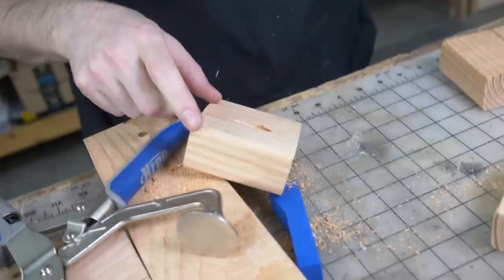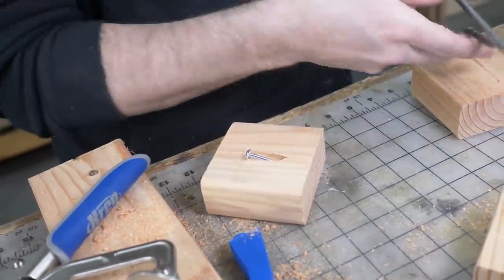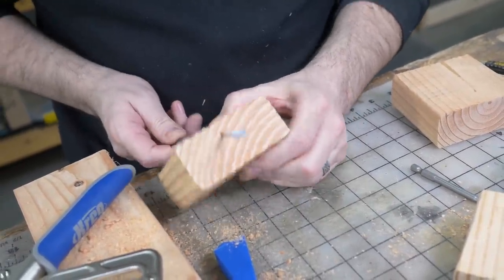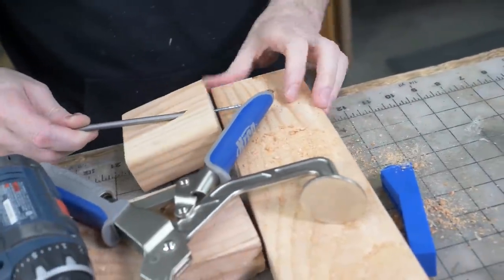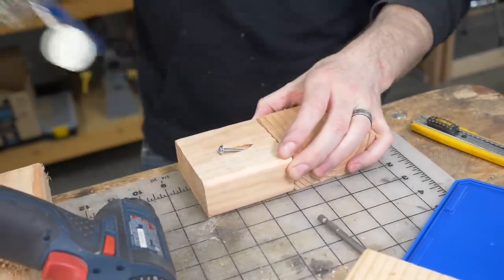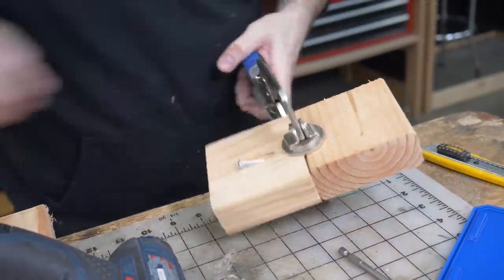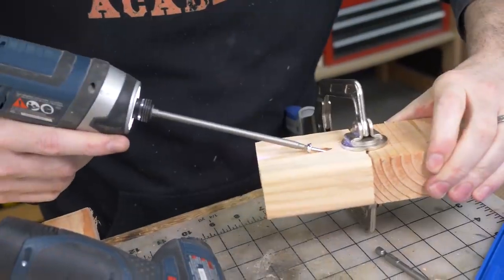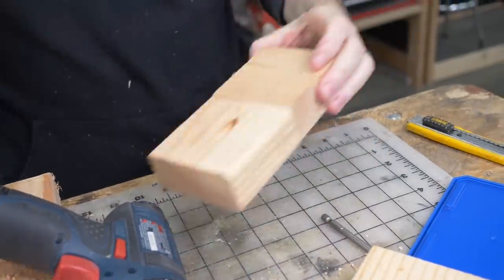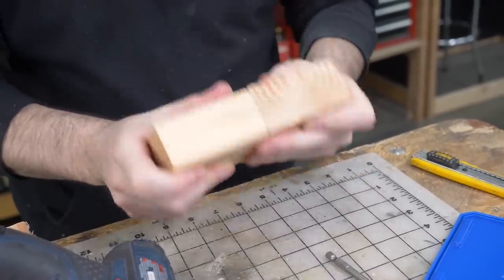That's probably about right. Now, there are specific pocket hole screws I need to use, and I even have this long drill bit to help me out there, and those should go in like that and connect into the other 2x4 like that. This isn't gonna join two together, this will be going kind of like that, and I can use my same clamp, I hope. And the big wide circle there should keep them flush, and then I should be able to do this. That's that. All right, obviously I'll have more than one per joint so it doesn't twist, but that feels pretty strong.